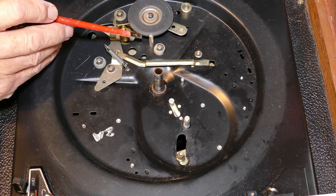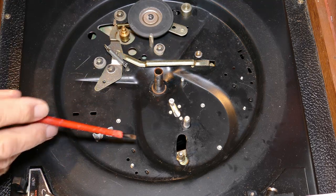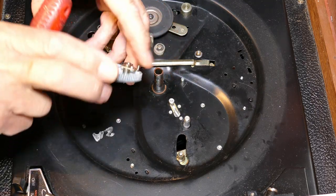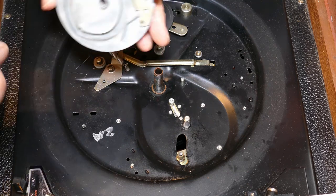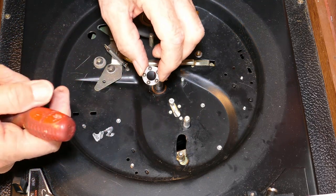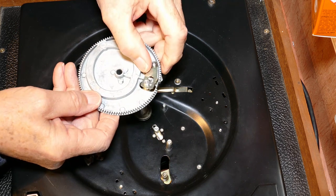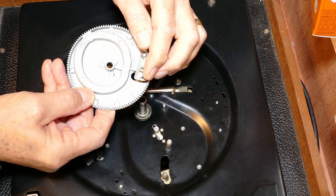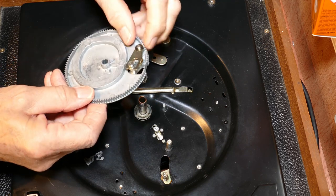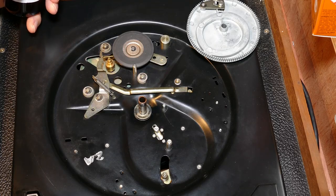Very important to make sure we don't get any oil or grease on the face of the idler wheel — that's most important. The jobs we're left with are to free up the cam follower with a little bit of lubrication, clean up the cam spindle, get the trip pull moving, and put some light grease inside the cam track. Then for the ball race we need to put some light grease on it and clean up the whole area. Here is the cleaned-up cam and trip pull. To get the trip pull moving I just had to remove the small circlip holding it onto its spindle, clean everything up with isopropyl alcohol, apply some WD-40 with a brush to the spindle, and now it moves perfectly freely.